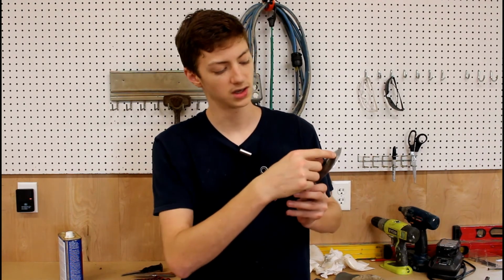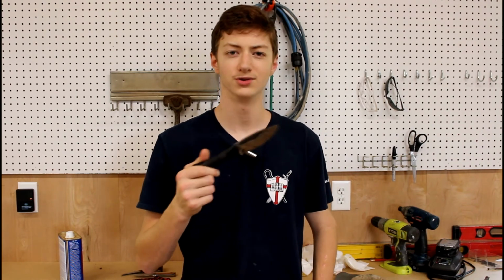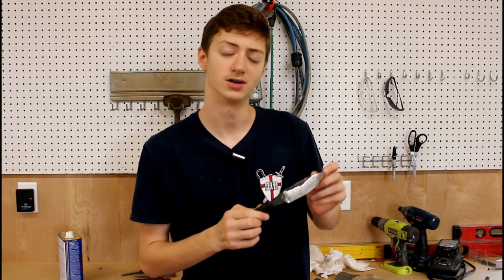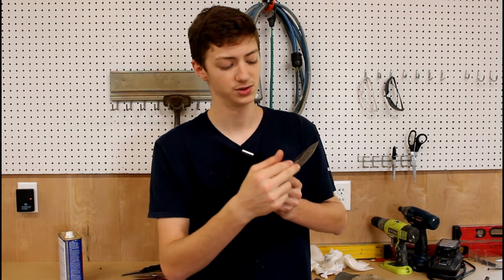They will coat the top part of the blade with clay on both sides, refractory cement usually, satanite, some sort of clay like that. And then when they heat the knife up and plunge it into the oil, the part under the clay cools down much slower than the bare metal going into the quench. And that produces this really awesome looking line down the blade that basically marks the difference between the part that's covered by clay and the part that's open. The soft steel of the spine to the harder steel of the cutting edge.